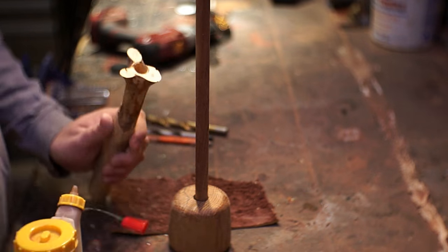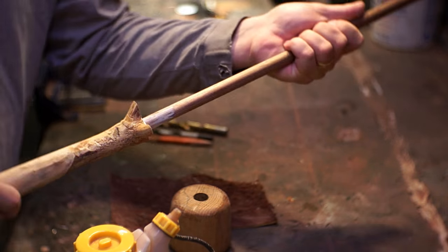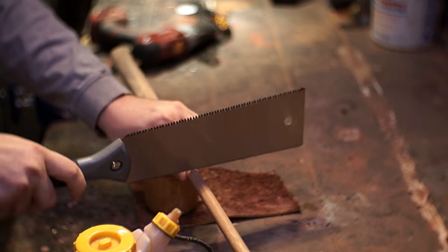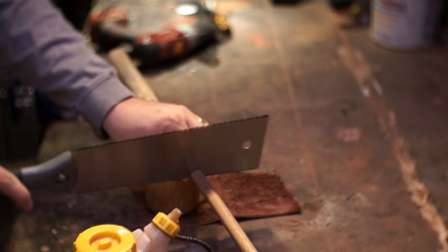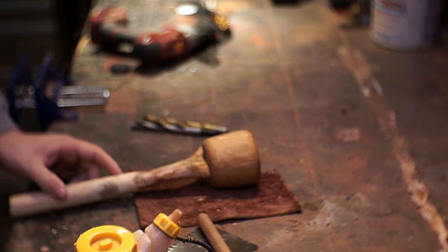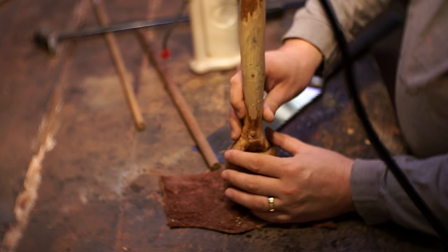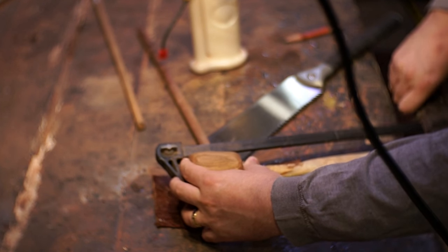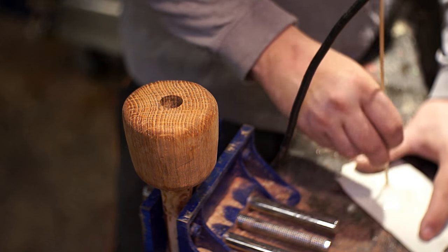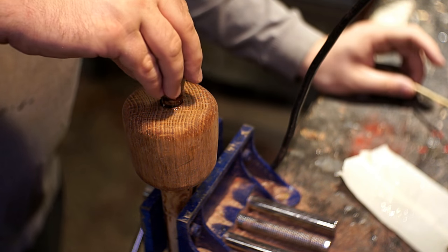After I marked out exactly where I wanted it to sit, I had to go back and glue the same dowel inside the handle. I'm not exactly sure why I used wood glue here instead of epoxy — looking back I probably should have just used epoxy for the whole thing, but at the time it seemed easier to glue it down first and then drizzle the epoxy in through the top. After clamping it to dry I filled it up with epoxy, heated it up so it would flow a bit better, then put the cap on top.